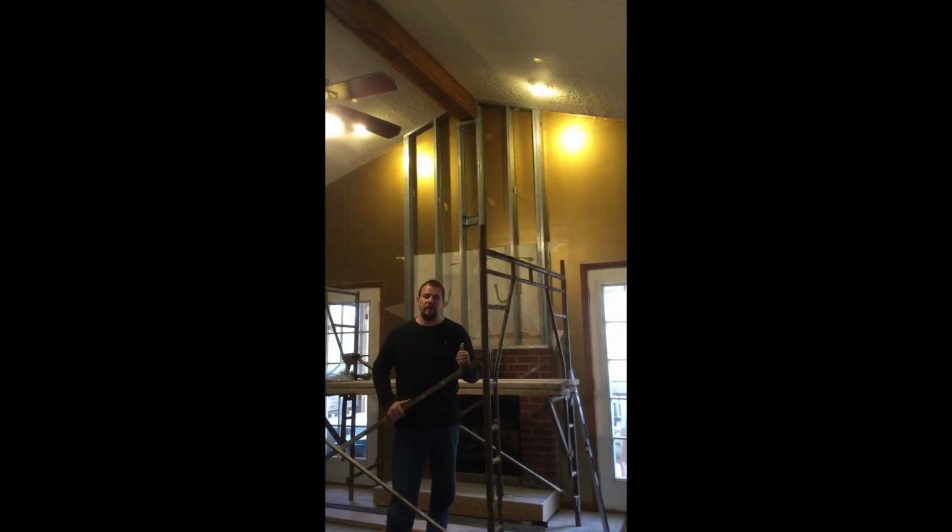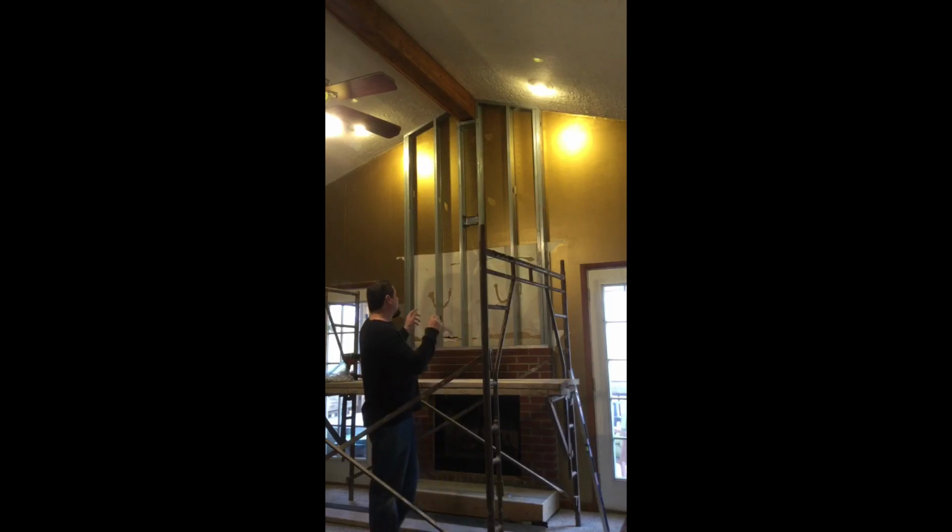So I'm almost finished with my framing. I use steel studs. I think they're easy to work with. I doubled up the corners for a little extra strength. I made sure the track and the studs that I put in actually lined up with the existing studs, so they've got some real solid tie into the existing wall. Those standard 2x4 studs plus the Hardie Backer is going to build me out even with my bricks, so I should be able to put a skim coat over everything. I think it'll work out nice.